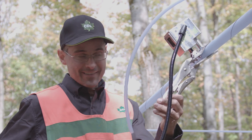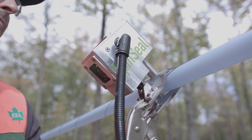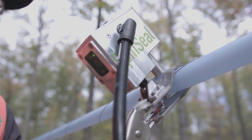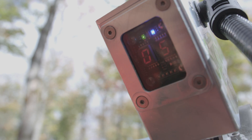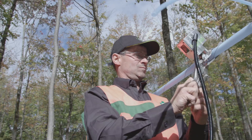Once positioned, push the green button while keeping your hand on the SpinSeal's clamp during the entire sealing process. The first time displayed, indicated by a green light, is the sealing time. Allow the cooling time to elapse for proper fusion. The cooling time is indicated by a blue light and a beep at the end.